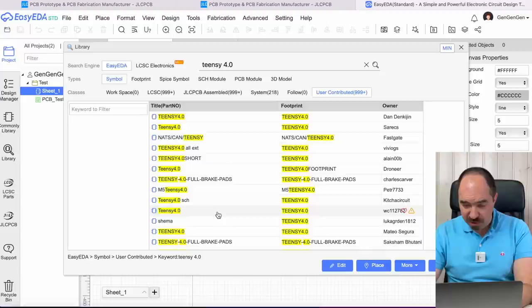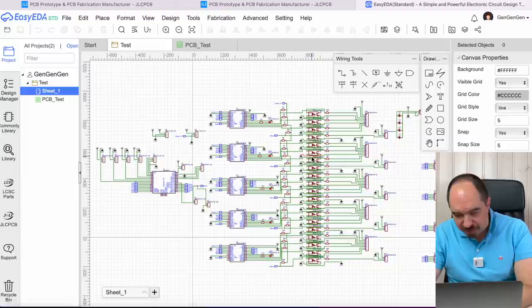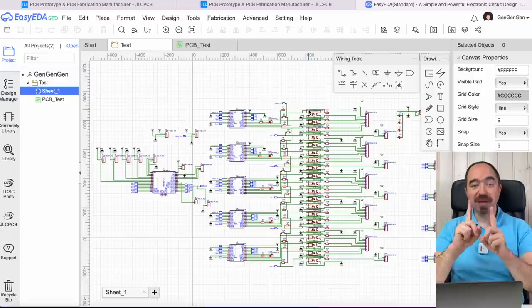So over here, what do I have? I have the Teensy, I have the 5 drivers, and I have optocouplers. In order to take the signal from the encoder, I use the optocouplers. In my first schematic, I made an error here and put the optocouplers in the wrong way, so I connected them wrongly.